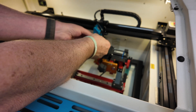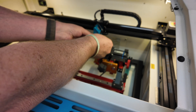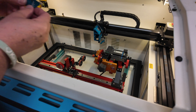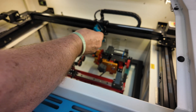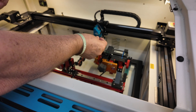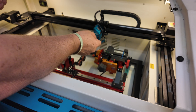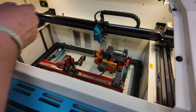From that earlier video, I spent hours trying to get settings for glass, and I actually cracked one of the glasses while engraving. I think where I went wrong is I assumed that meant my power was way too high. It actually wasn't the power that was the problem — it was my speed was too low. With these new settings, we're using a very high speed and a much higher power setting than before.